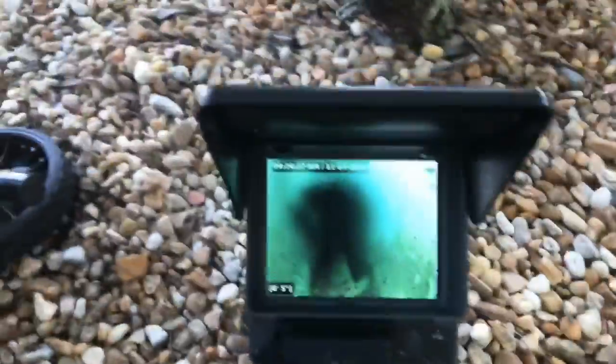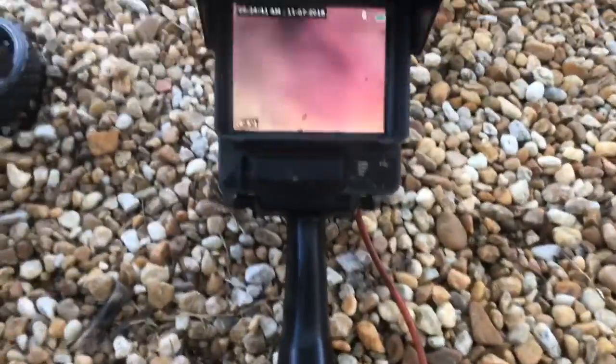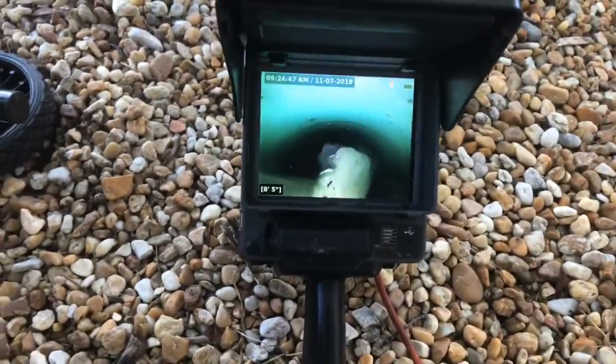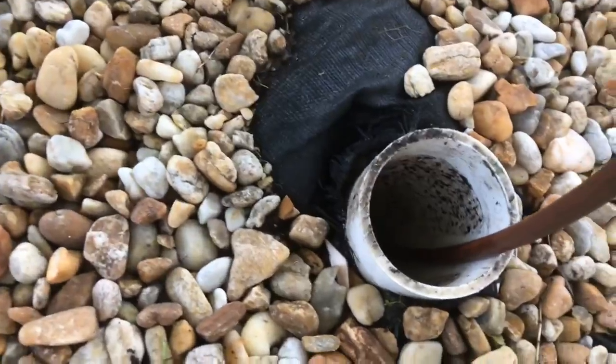We're going to inspect this. This is all going to go down right here, and I'll have your drain line open. But right here where we have that blockage, paper is caught around it. It's not the paper that caused the blockage. Okay. We're going to find out what this is right here once the water all goes down and we can inspect it a little bit better. Okay? That water's got to all drop down.